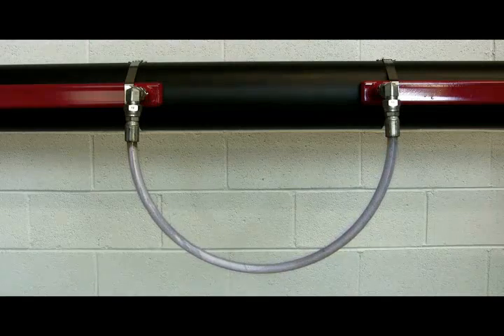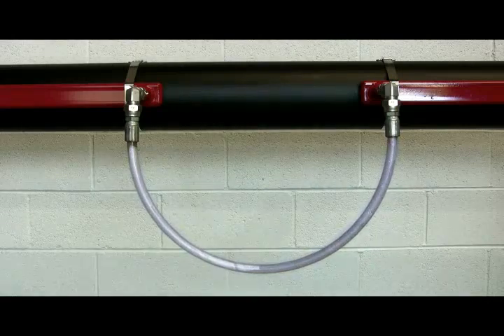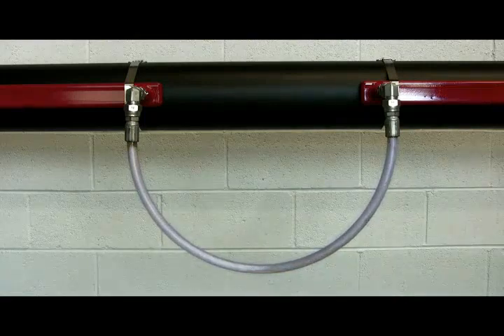In the uphill side of the jumper, a vertical column of condensate continually forms, is disrupted by steam flowing through the jumper, and then reforms to repeat the cycle. The height of the water column creates a static pressure drop which the steam must overcome to move through the jumper.